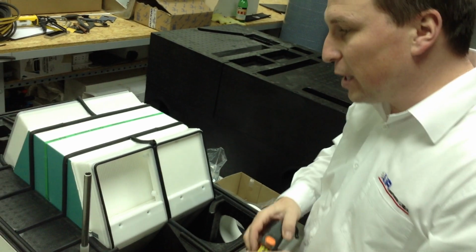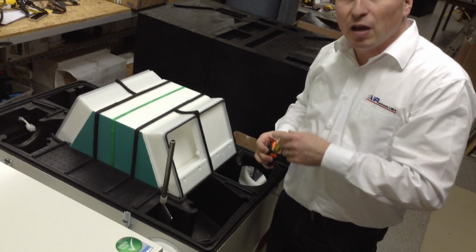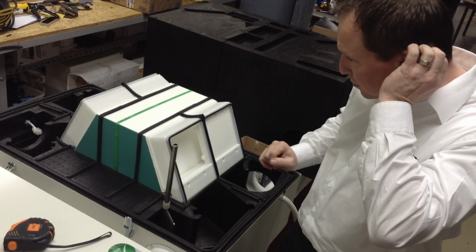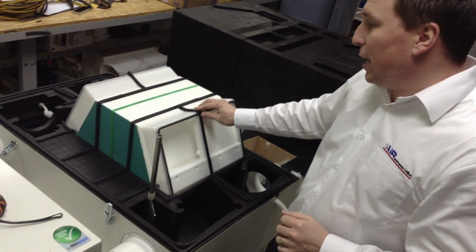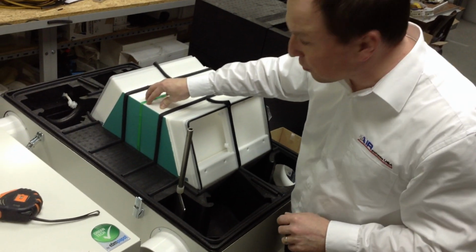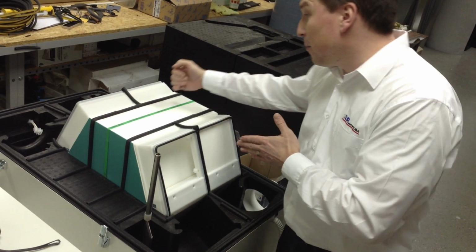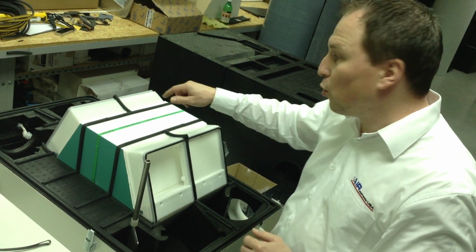Now I'm gonna explain to you how it's possible that we don't have any freezing even in very deep freezing temperatures. We have tried this unit up to minus 33 degrees in Holland 2 months ago in a lab, and basically the reason why it never freezes is very simple. We're not trying to reinvent the wheel or come up with some revolutionary approach. Even though the unit is revolutionary, we are using very well proven technology, actually from the 50s. What is so revolutionary? It's our ability to change which channels are being used for the travel of the air, and we have complete control over the process of moisture recovery this way.